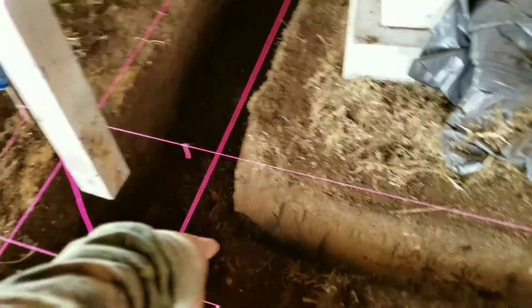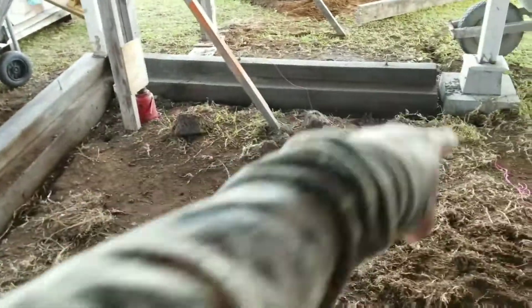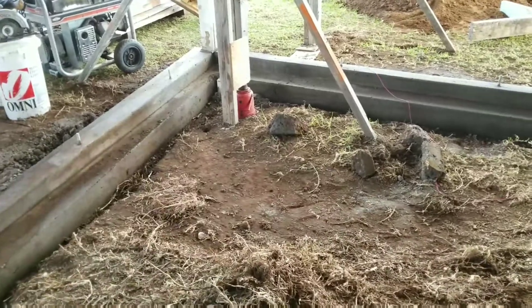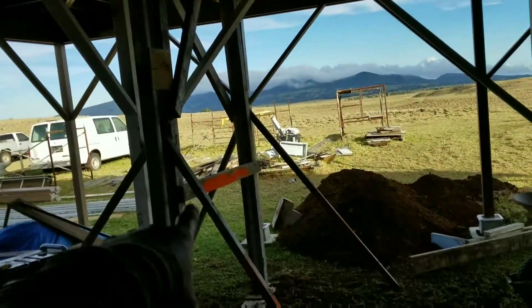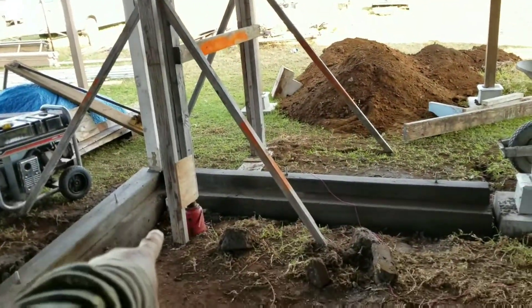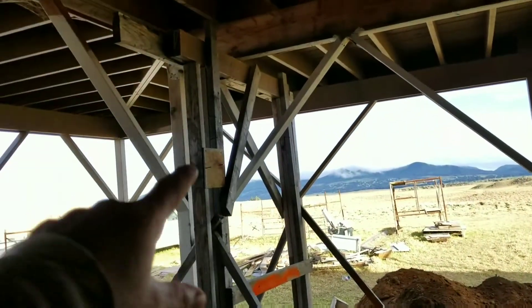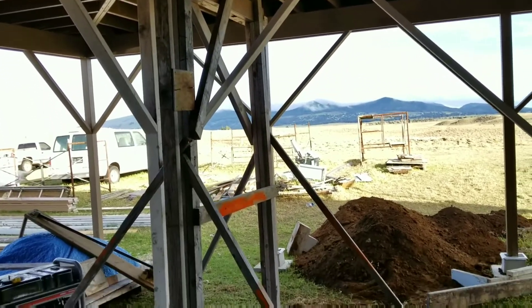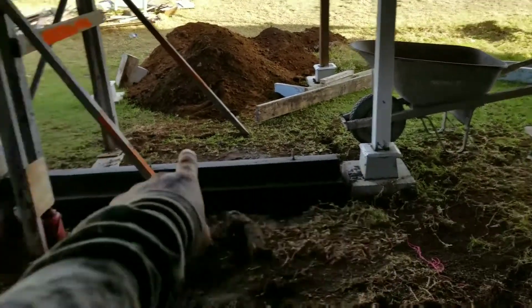It takes a lot of rebar to fill this in. The same way this one was dug out is the same way that one was dug out — the rebar was set inside, then they formed everything up and poured all the concrete. We also have supports on every corner wherever we're working — a bottle jack at the bottom and a cross beam going across my beam to support the corner of the home, so we can relieve pressure when we remove that concrete block.